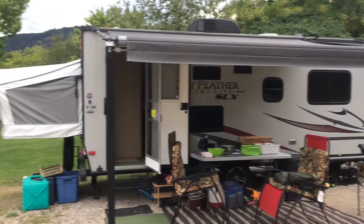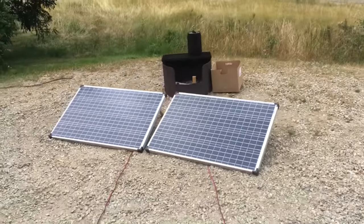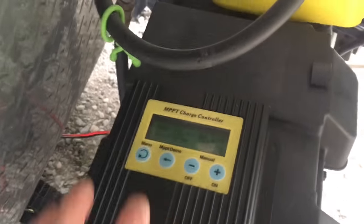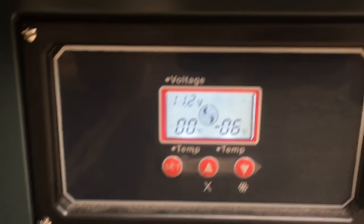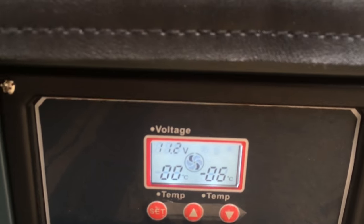This is our camp setup for the next two weeks. We have our 200-watt solar array aimed more westerly at the sun. The MPPT controller says it's snoozing — it hasn't seen much light. The batteries, according to this, are at 12.4 volts. Then over at the Unique cooler — the fan is turning, so the compressor is running — and we're at 12.2 volts. The batteries have not been bleeping last night.